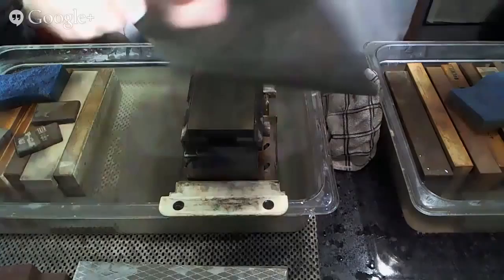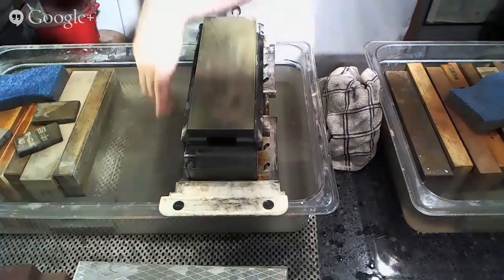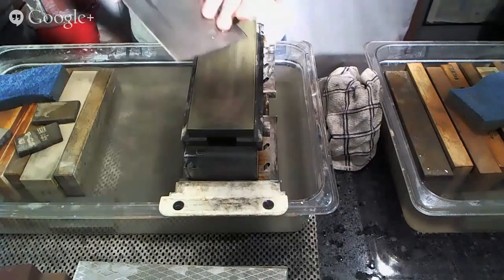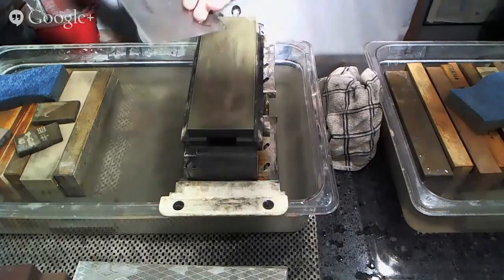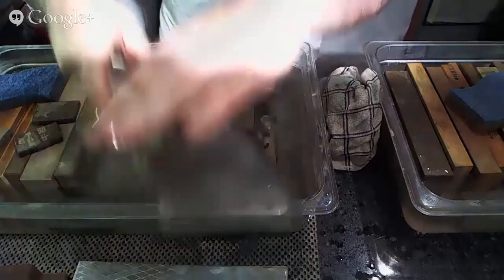And again, back to that stropping motion to help clean up the edge a little bit. The burr that I create isn't a massive burr. The goal is that as you get better at sharpening, you get more and more used to feeling for one so that you can create subsequently smaller and smaller burrs as you go. Because you don't want to be removing tons of metal each time you sharpen unless the edge is severely fatigued, in which case you may need to do that. But that's not often the case here for the knives that I'm sharpening.